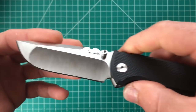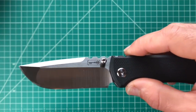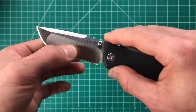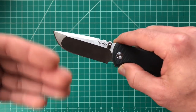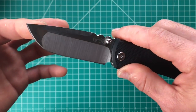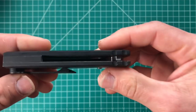On the blade the finish is beautiful. The compound grind has vertical striations from the satin finish, then horizontal, then vertical again on the spine with an almost diagonal on the compound. To clarify — this is a hollow grind with some concavity, then going out to a flat grind on the tip. That's what gives it that radius look at the transition. The finish is beautiful — you can see the shimmer as I change the angle. Absolutely well done.